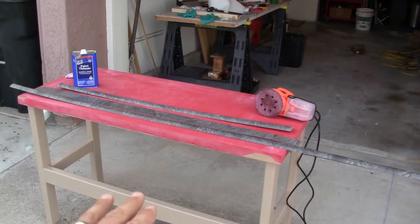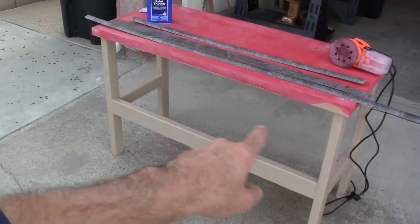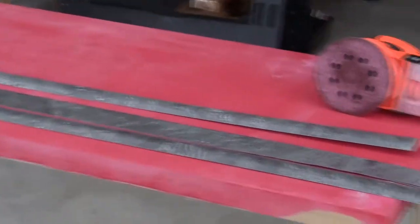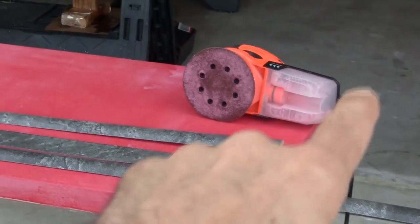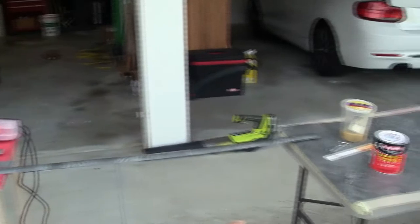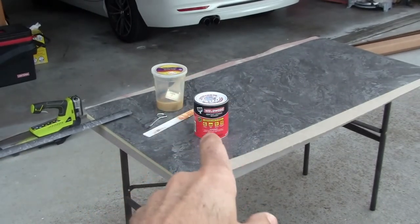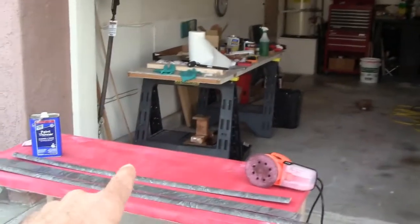Here are the materials for the project. Now because this table has a front and a back — we're looking at the back side now, you can tell because of this brace right here. The side on the other side does not have the brace, which is the front of the table. This particular table is going to be up against the wall. I'm going to do a flat section in the middle — that's going to go on this leg right here. The bullnose is going to go on the front side and also on the other side. For the tabletop, I'm going to use this piece right here, and we're going to use the original solvent contact cement. You can check out my channel where I do a comparison analysis of how well this holds up against the water-based version — but this product is the slam dunk winner, even though I've got the water-based back in the garage somewhere, so we're not going to be using that.